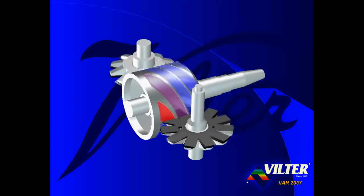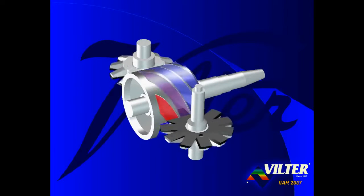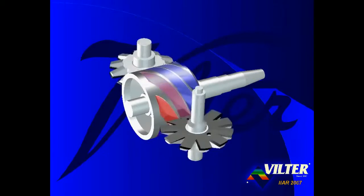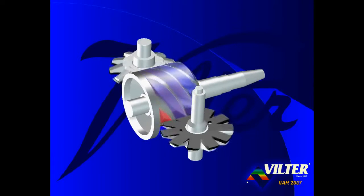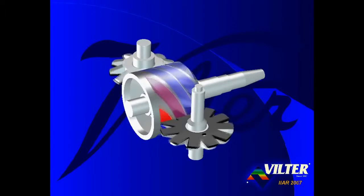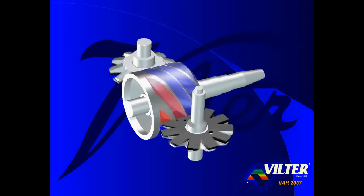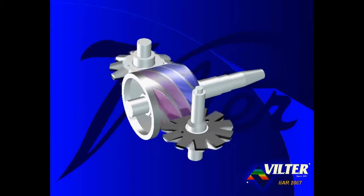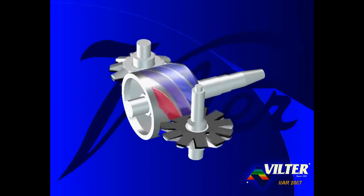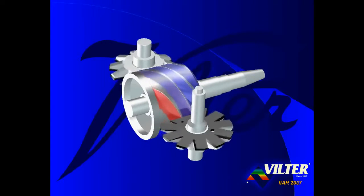As the tooth travels through the flute, the trapped gas is compressed to a smaller volume and higher pressure. With six total flutes, three flutes are engaged in compression on the top half of the compressor, and the opposing three flutes are simultaneously engaged in compression on the bottom half. The gate rotor on the opposite side is oriented identically to the gate rotor on the near side, just flipped over. Gas entering the flutes on the top half is compressed by the near-side gate rotor, and gas entering the flutes on the bottom half is compressed by the opposing gate rotor on the far side.